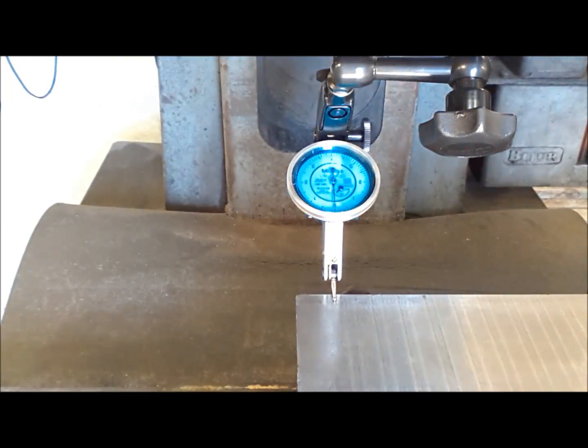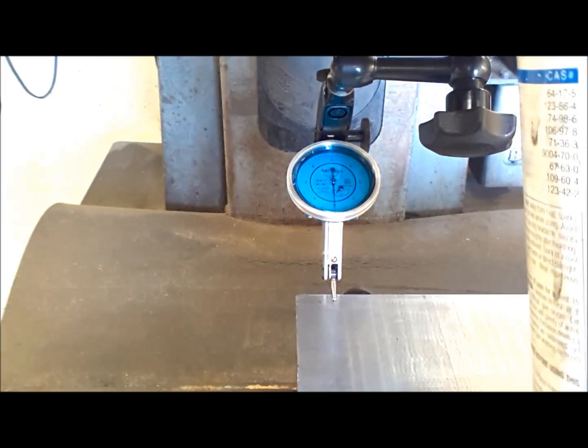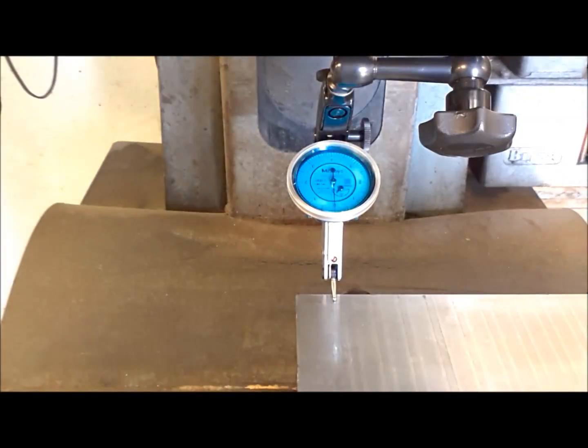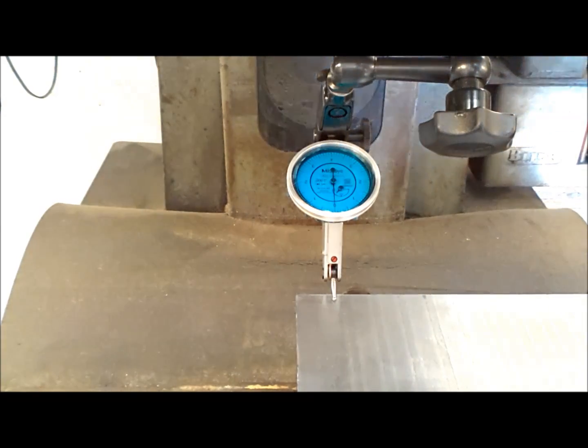What I did during stoning — I would dust it with Dykem, in the spray can — that's Dykem steel blue — just put a light layer on there, then drop the mag on and try to get a transfer. I did have some low spots and some non-contact areas. The contact areas were pretty consistent with the corroded areas and the non-contact areas were pretty consistent with the clean areas, so I kept working on the corrosion until I had contact all the way around.